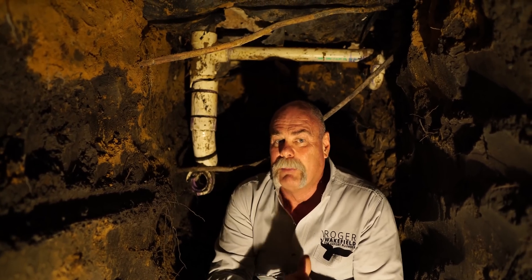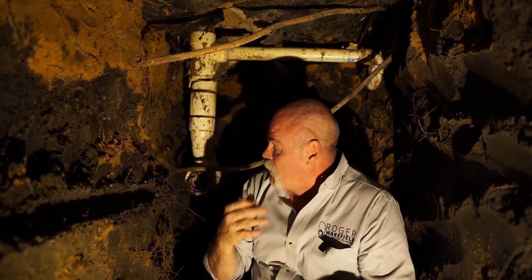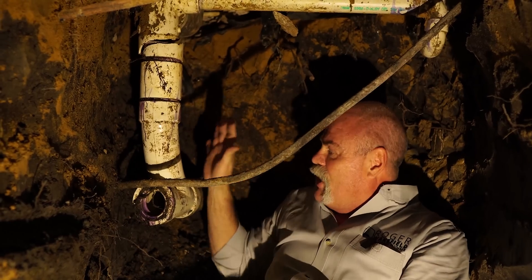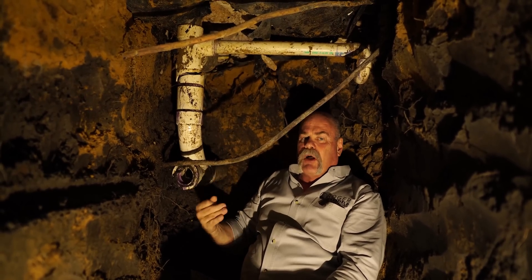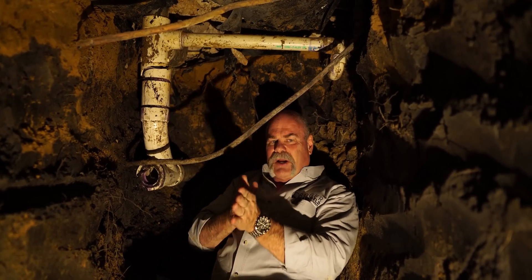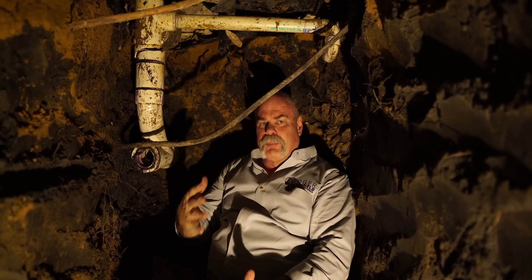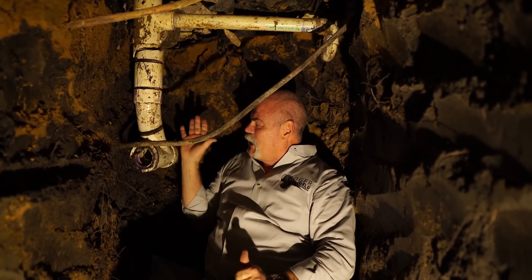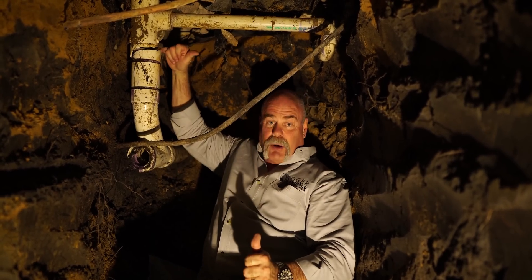This fitting has been here for about 30 to 40 years — the house was probably built early to mid-80s. To be honest, the copper lines look great and there's plenty of sand here; a lot of it was good. But anytime there's a break on a PVC fitting, something was not installed properly. When fittings are installed, everything should be stress-free — it should just sit right where it is, not in a bind, not pushing, pulling, or tweaking. Over the course of years in a bind, eventually it's going to break.